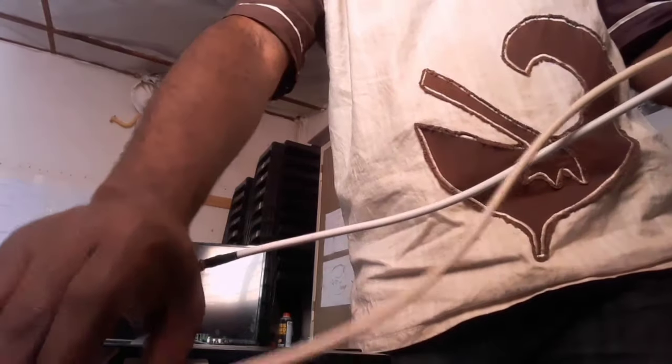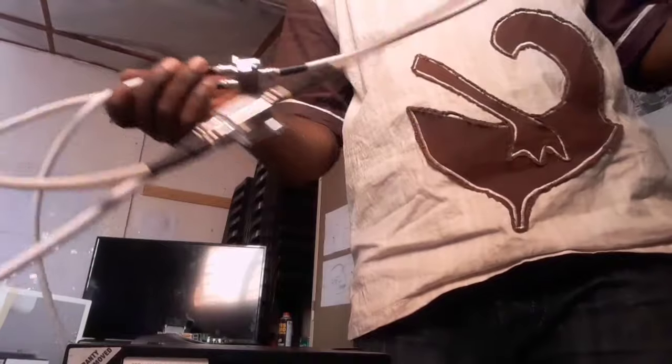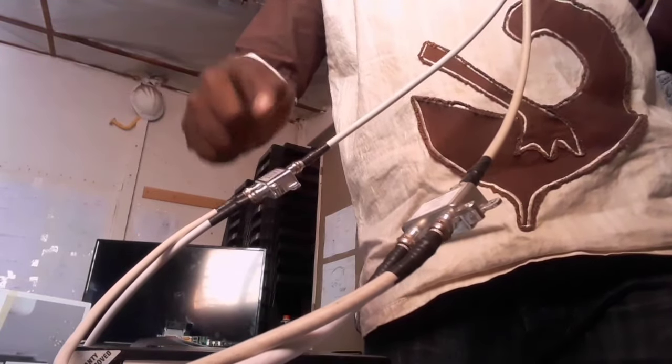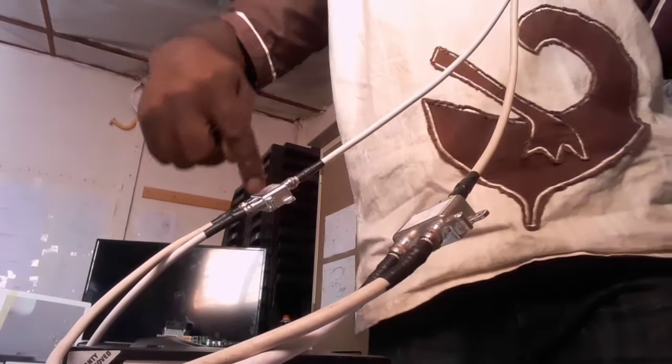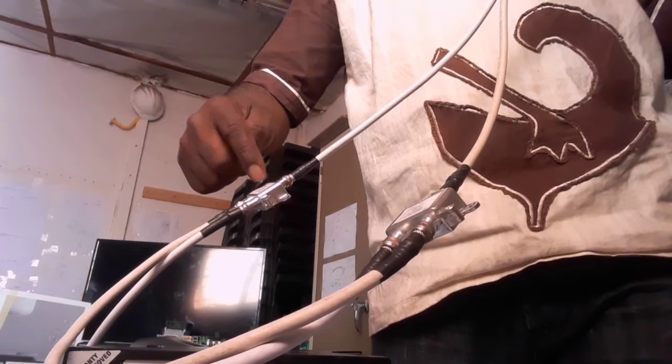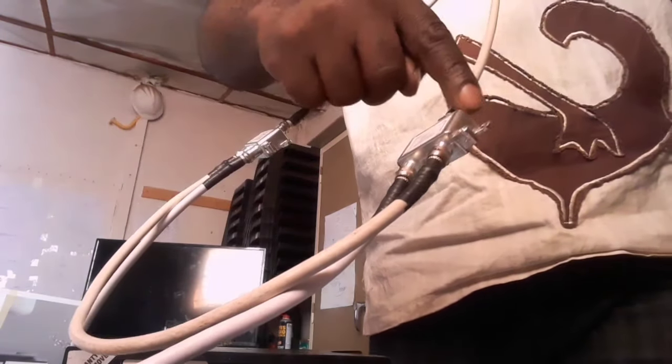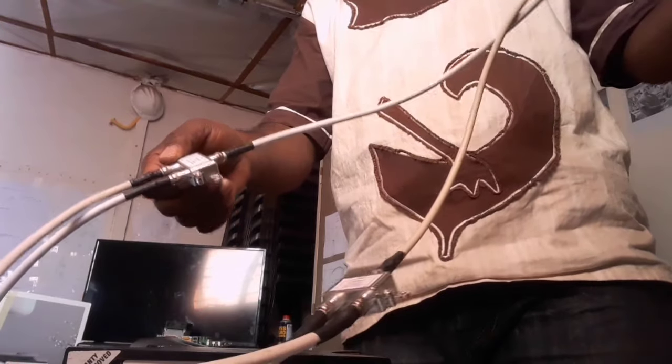Let me summarize this installation. On the twin LNB outside, you have two cables coming in. One goes to the IN of the first diplexer, the other goes to the IN of the second diplexer. When you come out, you have SAT out from both diplexers — one SAT out goes to the primary decoder, and the other SAT out goes to the secondary decoder. Then you run the heartbeat from the antenna port of one diplexer to the antenna port of the other.